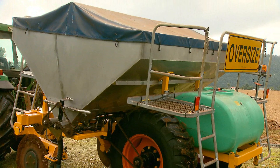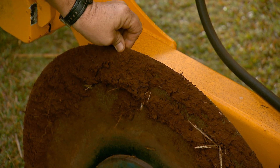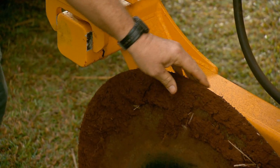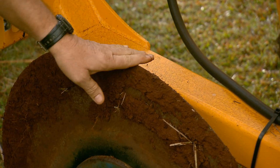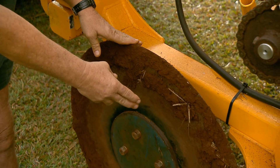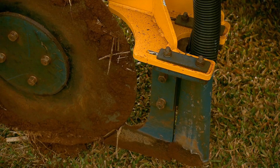Ensuring nutrients get to the root system of the plant and none is wasted. As you can see, this is red soil — it sticks very well to the coulters. It's a little bit damp at the moment but it sticks. Because it sticks and it's not very abrasive, it won't cut the trash, which causes the trash to build up, bind, lock everything, and jam. But with the modification in the tine and the bigger coulters, we were able to apply it underground through the trash blanket.